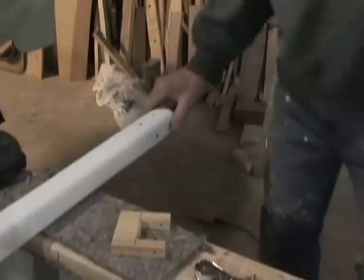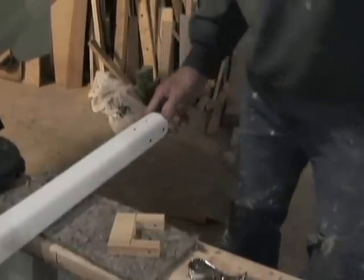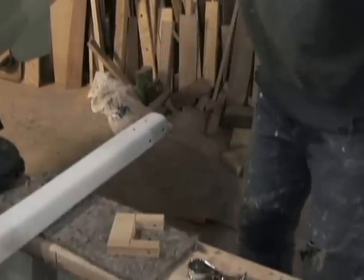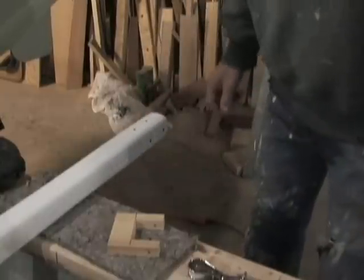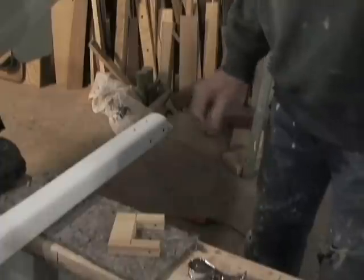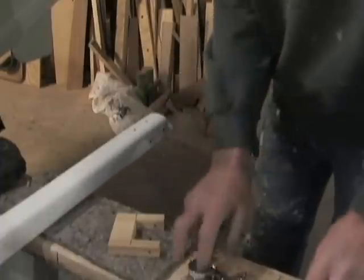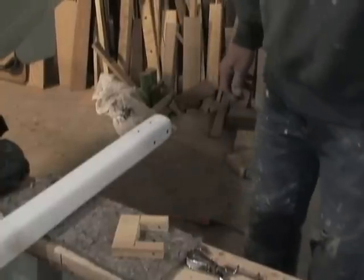And my bow chocks. This is the top of the main mast — I'm going to have two pulleys up here. A quarter-inch one on the front side for the two lines that'll end up making the lazy jacks and a topping lift, and then one on the back side with a pulley that'll hold my halyard to haul the sail up.